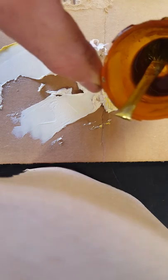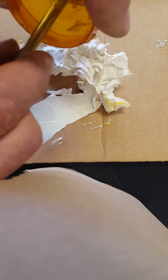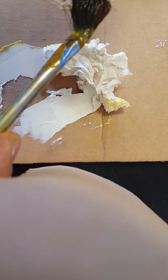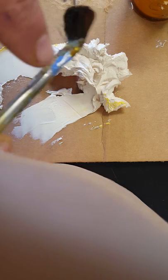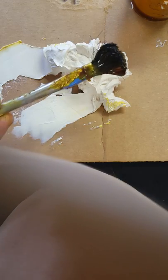In this jar you can see the yellow on the handle. What I've done is I tried the blue — you can see it here — with some Vaseline and some blue chalk, and that didn't show good on the gear.